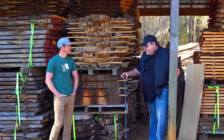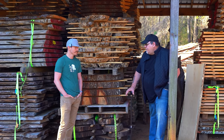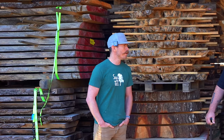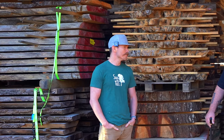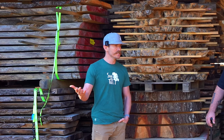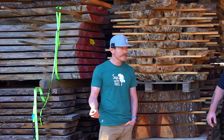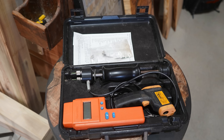Can you give us a quick rundown on how drying times vary by species at, say, three inches thick? Eastern red cedar and poplar are very low-density, soft woods that dry very fast — cedar also doesn't have a lot of moisture to start with, so one-inch-thick pieces could dry in six months or less. Sometimes the year-per-inch rule is actually hurting you because it can dry faster. On the other hand, a really dense species like white oak takes forever. A two-inch-thick piece of white oak will not be dry in two years — it may be dry on the surface, which is misleading, but a proper moisture meter will show the center is nowhere near dry.